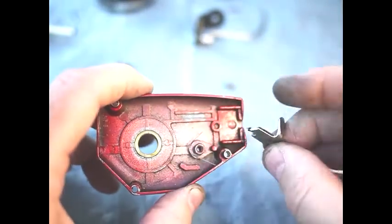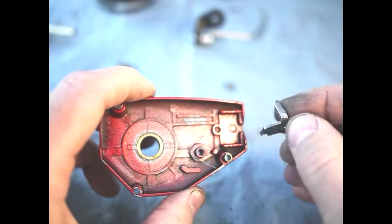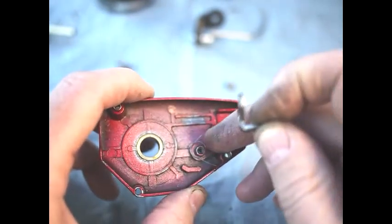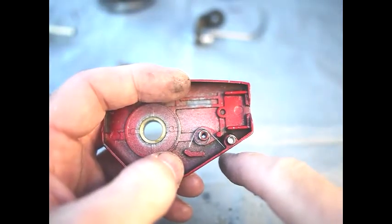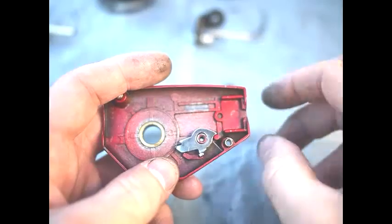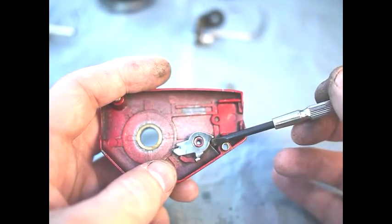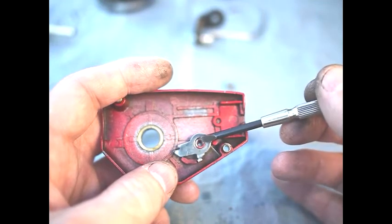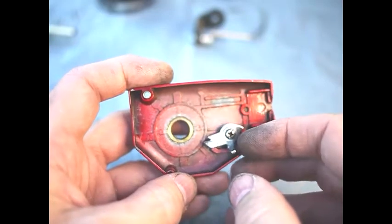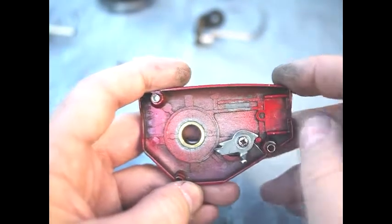And this piece here, this is the bit that connects with the serrations on the main cog. So it goes that way up. The little nub there goes over the divot just here. So just to clarify, you should have it lined up like that. You can just see it there, and then you should see your little spring is clipped under here, and the line bit goes here, and then you put your screw into there. So when the screw's down, it's designed in such a way that it leaves it loose. So there you go, like that.